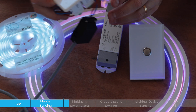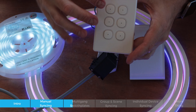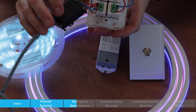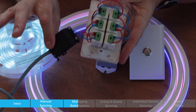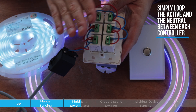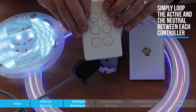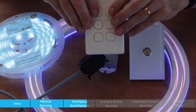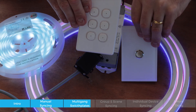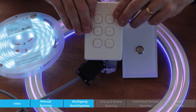It's also possible to have multiples of these in a plate. Here we've got a six-gang switch plate where each multi-function switch is connected simply by an active and a neutral looping between all devices. Each of these is a powered Bluetooth device — they're not controlling the load directly, but transmitting a Bluetooth signal to control whichever device they've been individually synced with or, through the app, whichever group or scene they've been instructed to sync with.